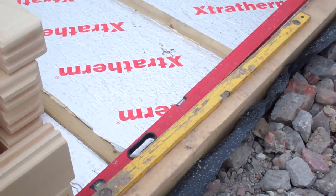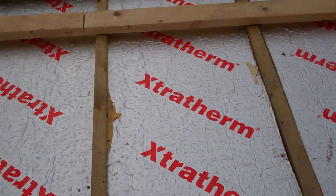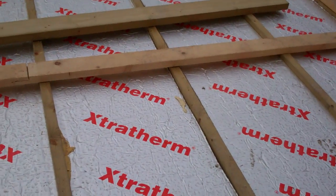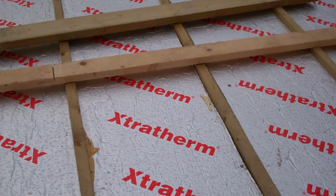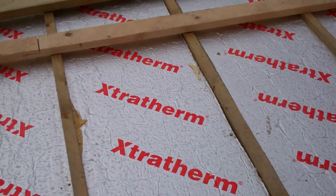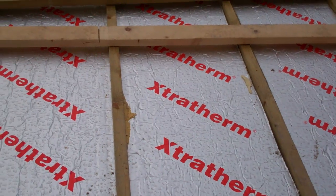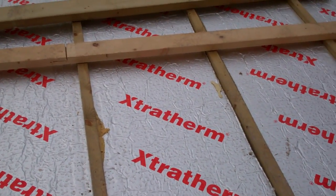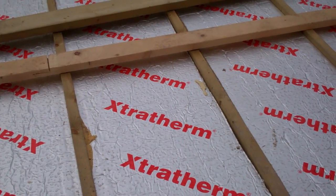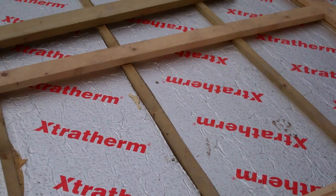We'll move on to the building itself. We can see that what we've done is we've put battens, 150 by 50s, at every 600 through the building. The benefit of that is it makes a very stable sub base, and we've put obviously some 100mm of insulation between, and very tight, which is important, between all the floor joists. So that's made up our decking base.